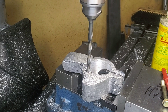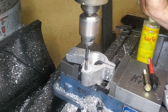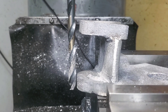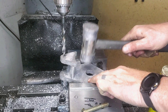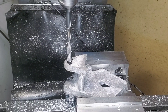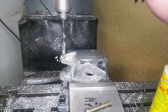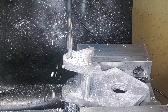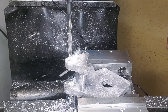I've got a drill bit that matches the shank of the bolt, and I'm basically drilling a clearance hole through. Now that I've got it drilled on that part, we're going to take it over to the other part. Can you spot a little bit of an error that happened when we were packing all that in the sand? That's right — this is lost foam casting and it's a pliable surface, meaning when you pack it in the sand, things are going to move and you're going to have problems. This is a bit of a designing error. Remember that bolt from the parts bin — it's actually a metric bolt. We're going to drill through the top side just to the shank diameter, then poke it through onto the other side, leaving a little tiny spot face just so the next drill won't walk everywhere.